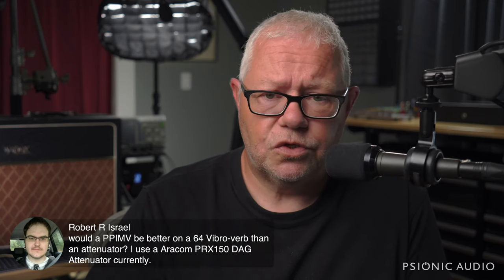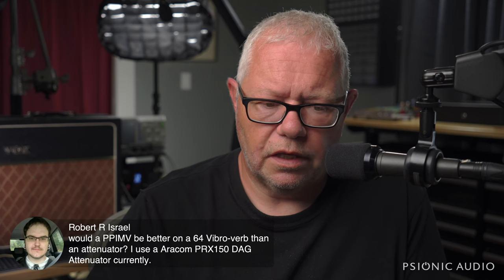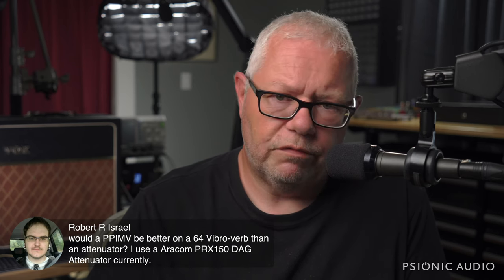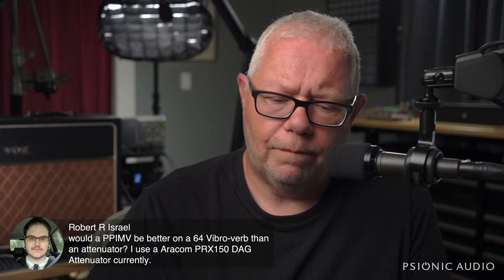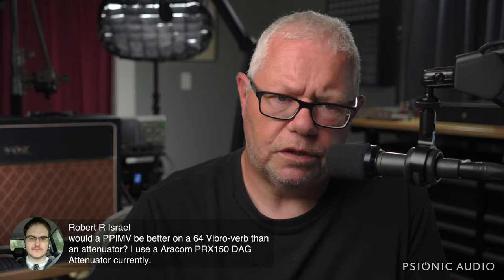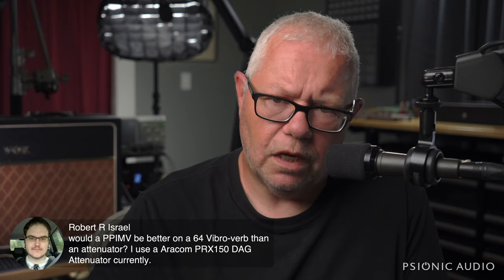You can get distortion from '60s Fenders. Most of the distortion you're going to get from those amps is in the preamp, because the phase inverter is a 12AT7. It's all in a negative feedback loop, and it's got 6L6s in the case of the vibroverb. Everything there wants to stay clean, and there's no saturation in the output transformer of a vibroverb. A little bit more potentially than with a twin, but it's not like a vibrolux.